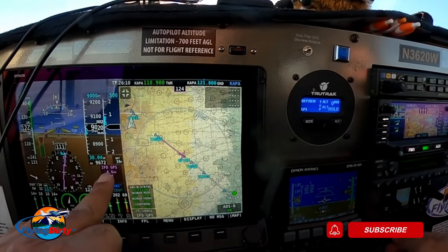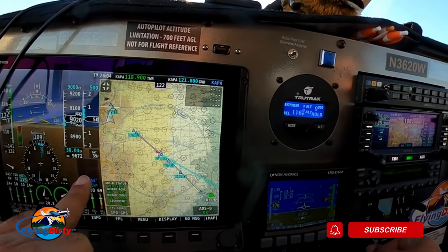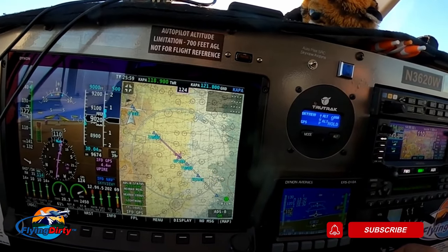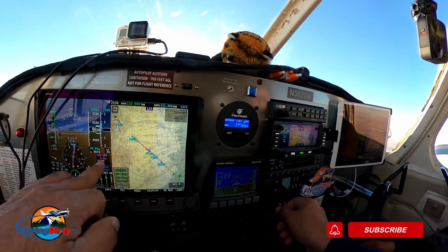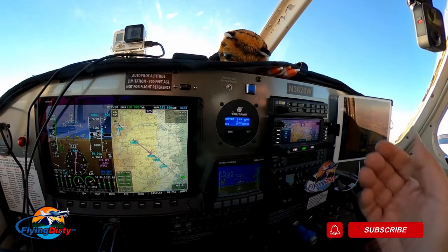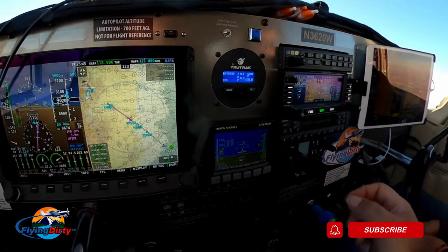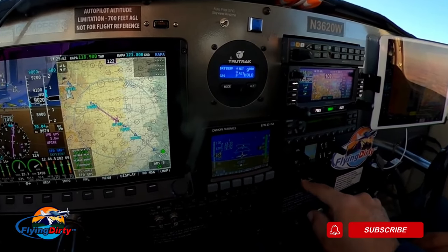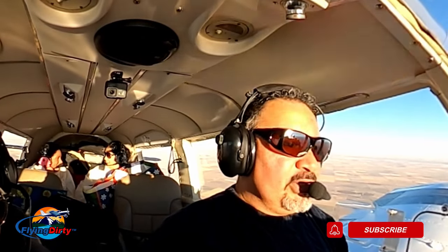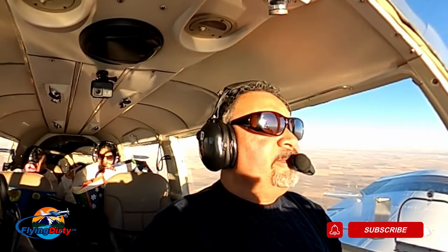The vertical speed is also captured on the TrueTrack when in Skyview mode, which is a positive. If I click this until it turns off, I can control the autopilot with the heading bug instead, but I prefer GPS mode. Going back to GPS, it'll fly the GPS flight plan as shown on the display and the Avidyne. By toggling modes I can control not only the altitude but also the track — those are the features I like most from the TrueTrack.